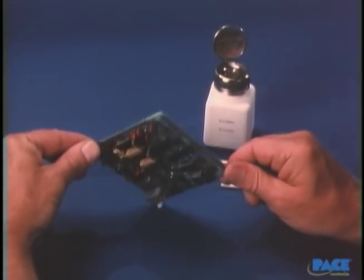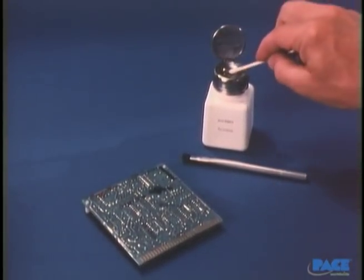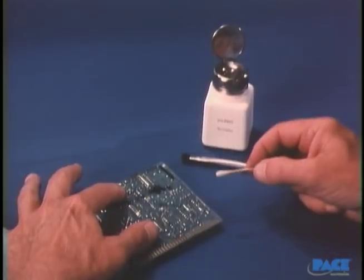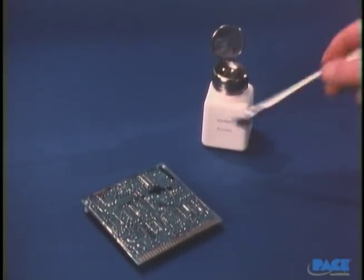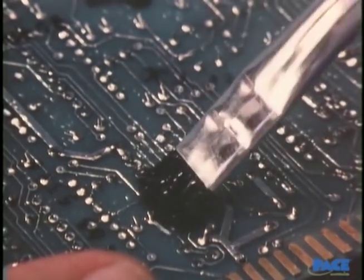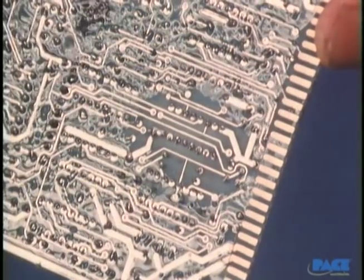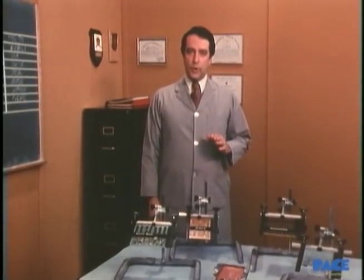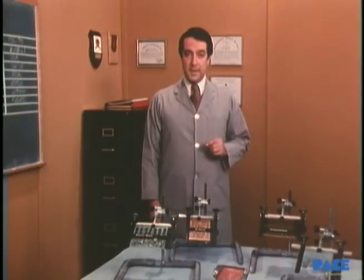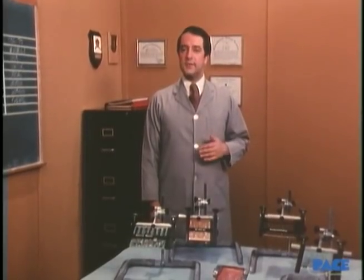Let's take this board to begin with. The coating's thin and transparent, so acrylic lacquer is a good possibility. Using xylene or another similar mild solvent, a test is made first, brushing a small amount on a non-critical area. It dissolves. So now solvent is applied to each of the solder joints at the repair site. Several applications may be necessary to completely remove the coating and prepare the area for solder removal. In most cases, we need remove only enough coating to get to the area being repaired. Sometimes, though, removing all of it from the board may be required — usually done with a continuous flow of fresh solvent or by soaking the board in a series of solvent baths.